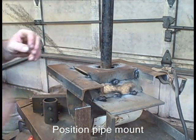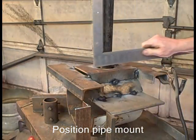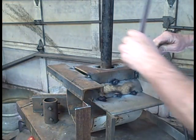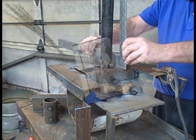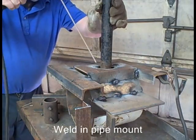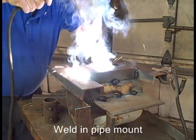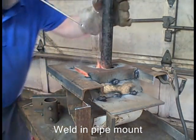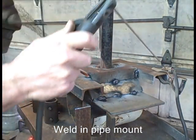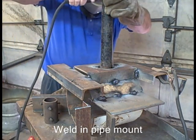Be sure you use black pipe whenever you're using any of these materials welding. Do not weld with galvanized or any coated materials. They'll give off fumes when you're welding it, and they'll make you sick and literally could take your life. I've got a friend I knew, a blacksmith I knew, that was a little careless, and he actually got sick and did die. Somebody we miss.